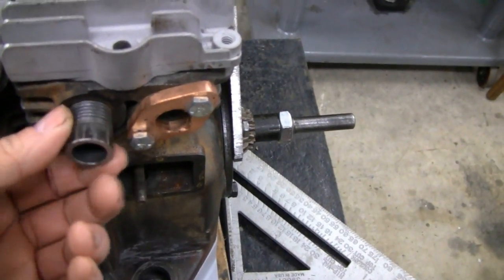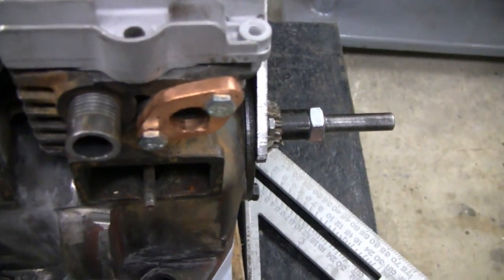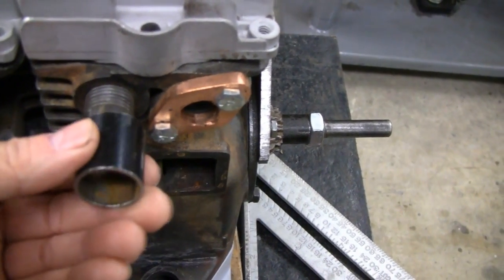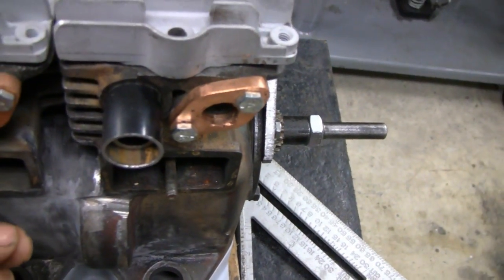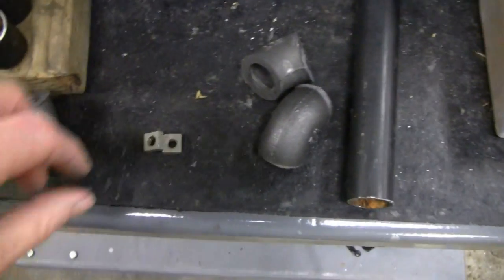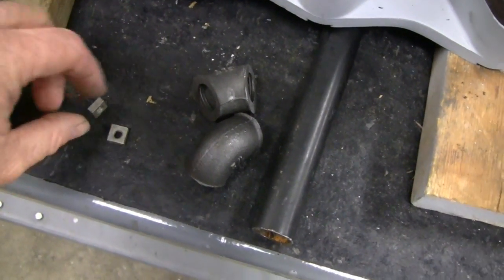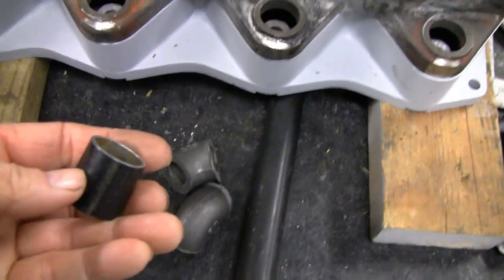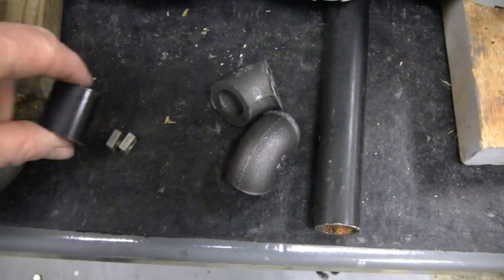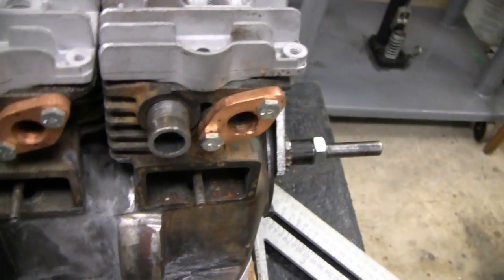What I came up with is I cut these — if you look, it's actually not a nipple, there's a little shoulder on there. So I got a pipe that would just about slip over it, giving me a little stub about an inch long. What I'm gonna do is get two square nuts, drill through one of them, and use the nut end on the other side. I'll put a slit in the pipe — not all the way to the end, just barely — so I can weld them on the bottom and tighten it up. You'll understand better when it's all put together.